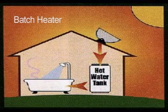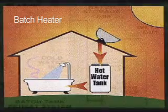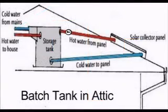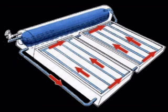Although this design is inexpensive and easy to install, no attempt is made to separate the heat collection area from the heat storage area, and much of the heat from the tank is lost through the glazing. There are some passive thermosiphoning batch heaters that separate heat collection from heat storage. These systems are definitely an improvement over the simple batch heater, but their heat storage capacity is normally quite small.